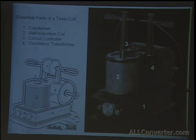These oscillators are expressly intended to operate on direct and alternating currents and to generate damped and undamped oscillations or currents of any frequency, volume, and tension within the widest limits. They're compact, self-contained, require no care for long periods of time, and will be found very convenient and useful for various purposes as wireless telegraphy and telephony, conversions of electrical energy, formation of chemical compounds through fusion and combination, synthesis of gases, manufacture of ozone, lighting, welding, municipal, hospital, and domestic sanitation and sterilization, and numerous other applications in scientific laboratories and industrial institutions. While these instruments have never been described before, the general principles underlying them were fully set forth in my published articles and patents, more particularly those of September 22, 1896.